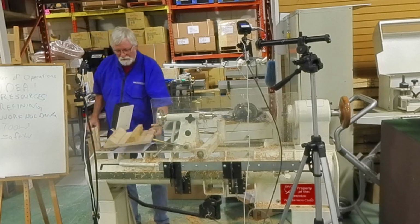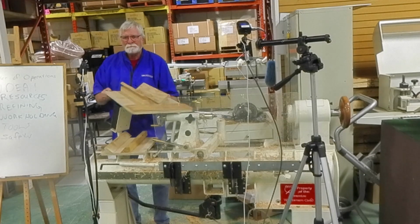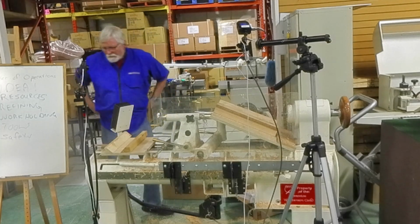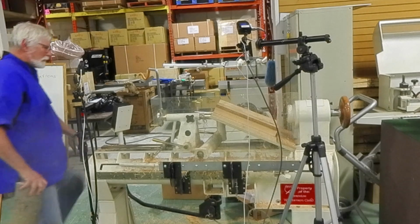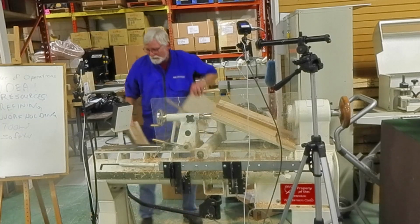So one safety thing I didn't mention, I was going to mention it, and I forgot. It's cutting on a bandsaw. So if you're ripping something round, if you can get it flat, this is good. If you're ripping something round and you're putting it through your bandsaw round, this is bad. This is bad. So what you make is a very simple jig for cross-cutting.